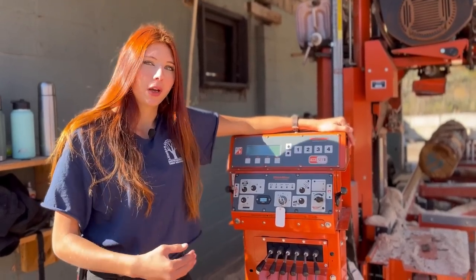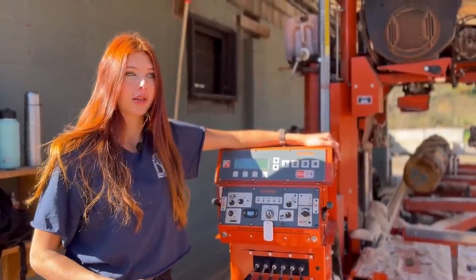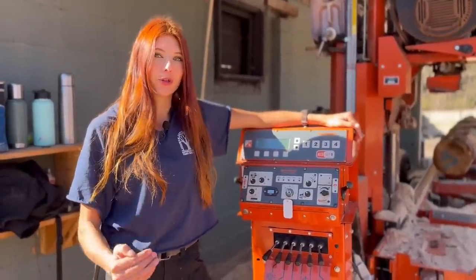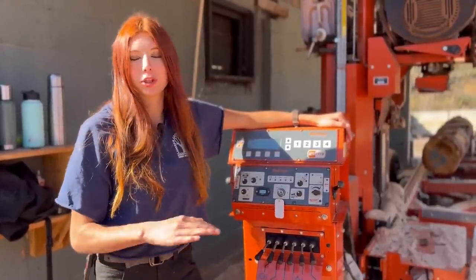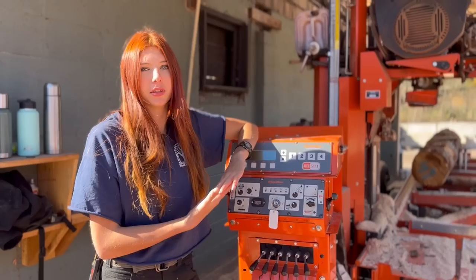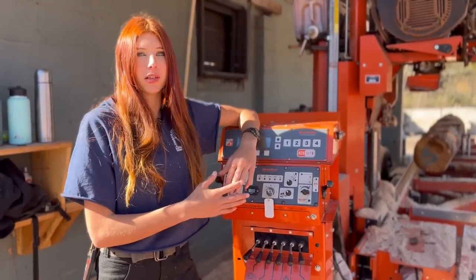I'd have to show you for you to fully understand that unless you've had experience with it. But you want to avoid going too slow because it is visible on your lumber. That can be a clear indication that you need to speed up, but sometimes it's not always that simple. When I've cut into hardwood logs before, I could tell the machine was struggling and it couldn't go any faster, but you still got those slow chatter marks. In the end, it's not really a matter of just going slower or faster — there's a lot that comes into play. Blades, if you're cutting hardwood, you might need to change to a different degree of blade.